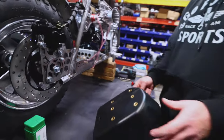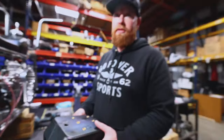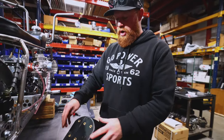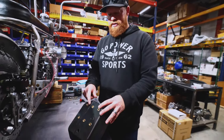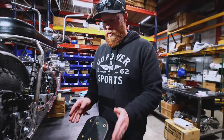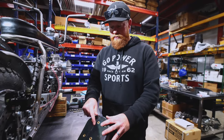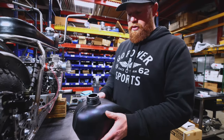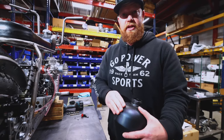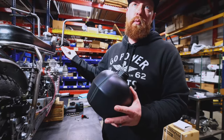Are there any no-no areas? No — don't worry, because this is not a seam. That is a tooling mark. This is all one solid piece of plastic. This is not a seam where two halves are glued together. This is a tool that splits apart and that is the line that the tooling makes. So if you go to paint it or something, it'd be a good idea to take a sanding pad, smooth that out, get a nice smooth finish — which we're going to do on this tank before we paint.